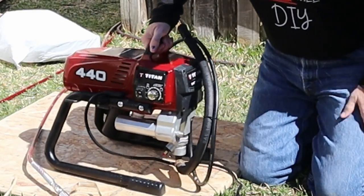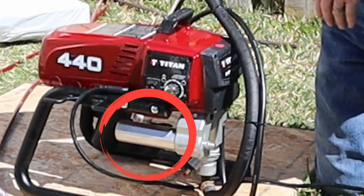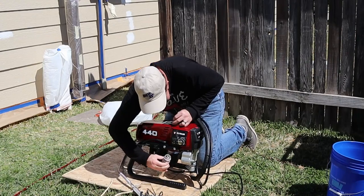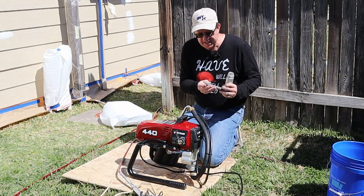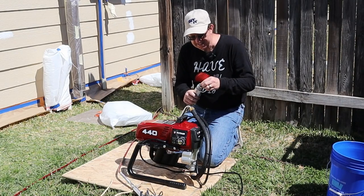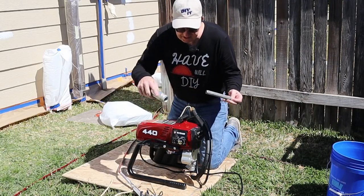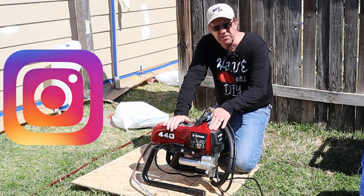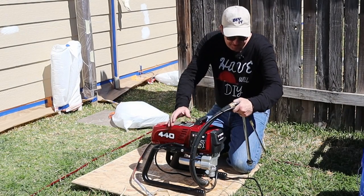On this particular model, there's a filter cartridge down here and you want to make sure it's clean before you start, especially if you're renting one. Don't do what I did — rent one and find out they didn't clean it. If you're going to rent a sprayer, run some water through it before you put your paint in. When I rented one, the previous user didn't clean it and I had purple-pink paint coming through. If it's a new machine, it comes from the factory with lubricant, so run water through it to clean it out.